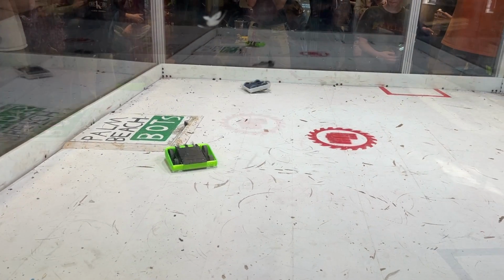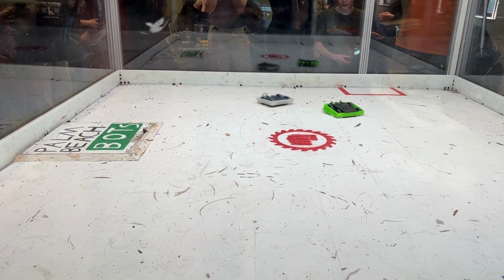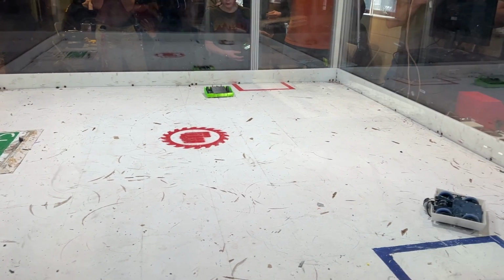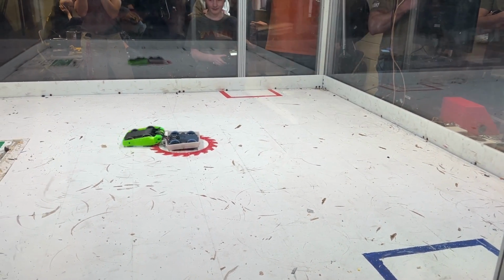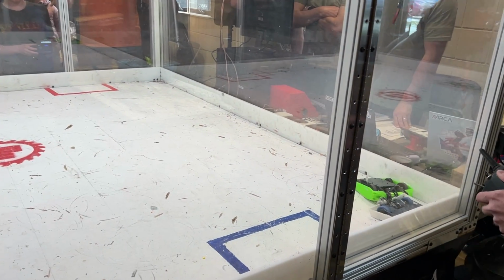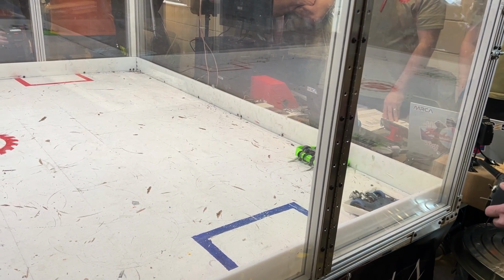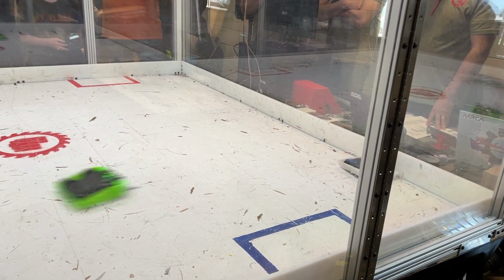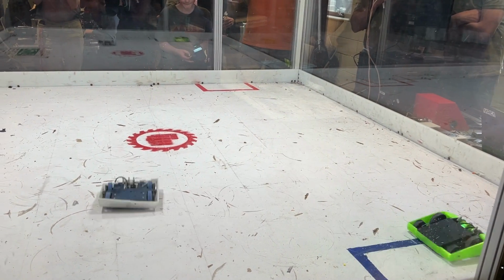About a minute or so left in the fight, we make one more weapon-to-weapon contact, and this is where both of our weapon systems go down. At this point, the structural damage to the robot occurs. I lose one of my weapon cage pieces, and with his case, Retribution has 2 belts that are driving the weapon system, and this impact caused both those belts to pop off, twist, and wrap around together, and it gummed up his weapon system like that.